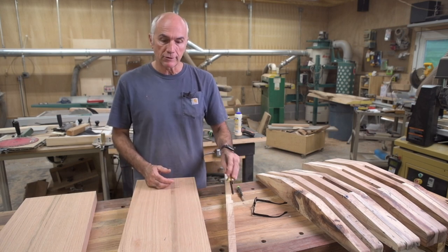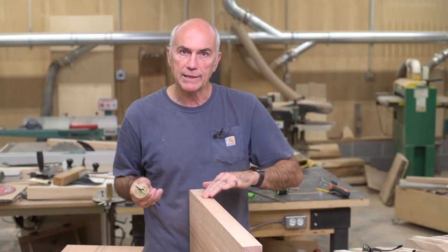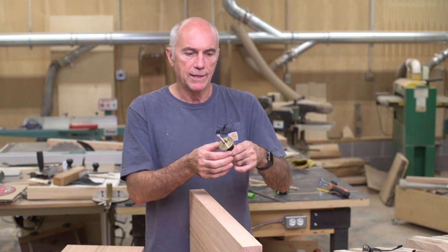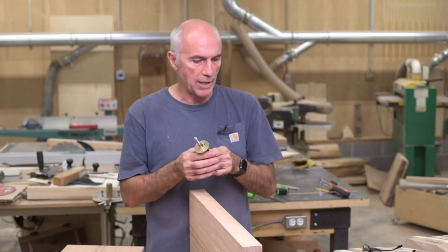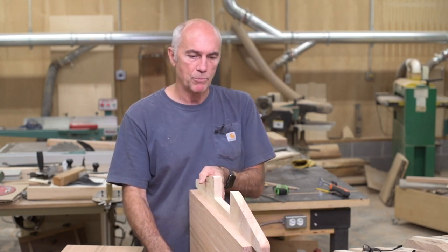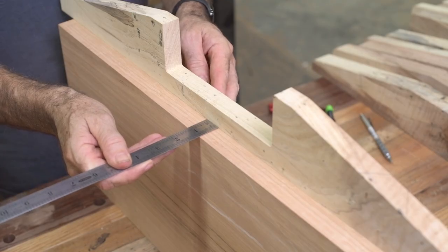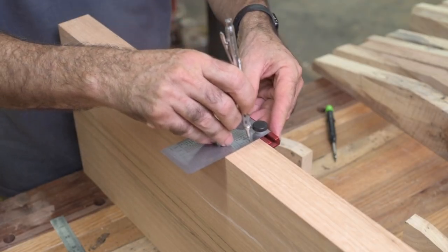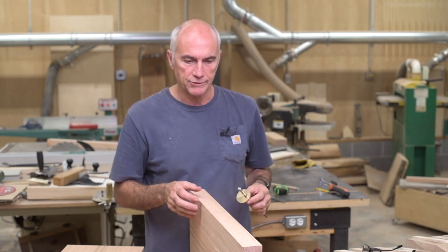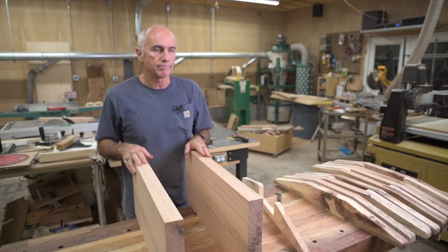I'm using my marking gauge to measure the mortise and put the corresponding mark on the upright piece for the tenons. What I've done to make sure I can get the tenon in the center of this piece is use a dual marking gauge — there's a couple of adjustments I can make: one is the width of the tenon and the other is where it falls on the piece of wood. I used my mortise piece and set the width of my tenon using that. The difference is one inch, so if I divide that by two I get a half an inch. I put a mark at a half an inch, then set the second adjustment on the marking gauge shoulder to that line, and that should get us close to center. I'll reference the same side of the board all the way around. I've got everything marked up, but I don't think I'm going to cut the tenons tonight — tomorrow's another day.